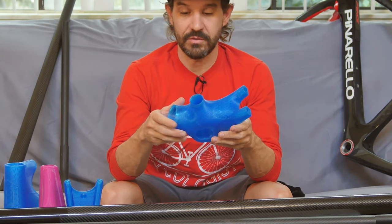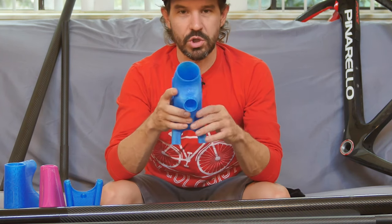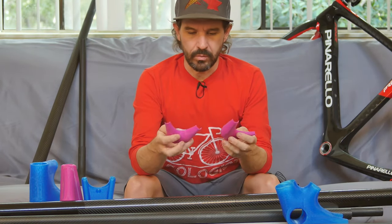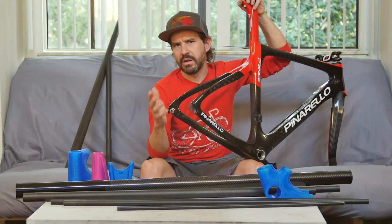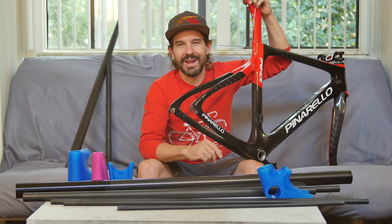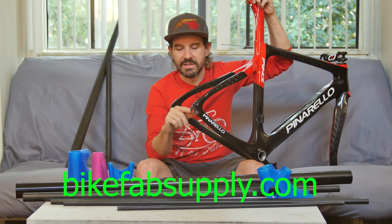And then the bottom bracket — another very tricky part, but my surfacing skills are kind of coming into their own. It's got some nice continuous curves, though I'm not totally sure about the clearance for the tire, but that's why we build prototypes. That's the bottom bracket — looks pretty cool. The last major parts I needed to design were the rear dropout holders and the threaded bottom bracket. For the actual dropouts themselves, I'm using prefabricated parts from bikefabsupply.com — a really cool source for frame builders, so you don't have to make these universal parts yourself, which gives me a welcome savings of time.